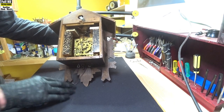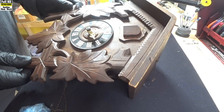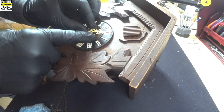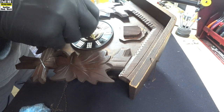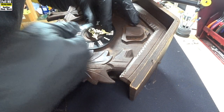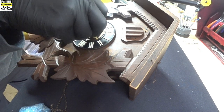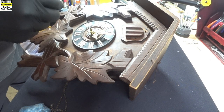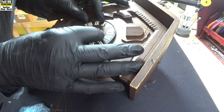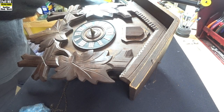We'll start to take this to pieces. First thing we'll do is remove the hands. Undo that knurl nut there — take that off, then there's a washer underneath. That minute hand portion is screwed down, so we'll remove that and put it aside with the rest of the hand pieces. That's the minute hand off. Now the hour hand — it's held on by friction. Put my fingernails under it and just lift it up. There it is, it's come off. Put them aside.